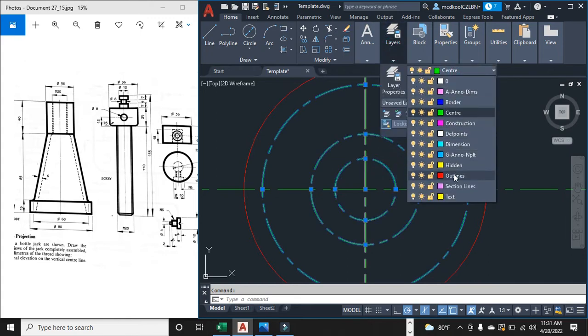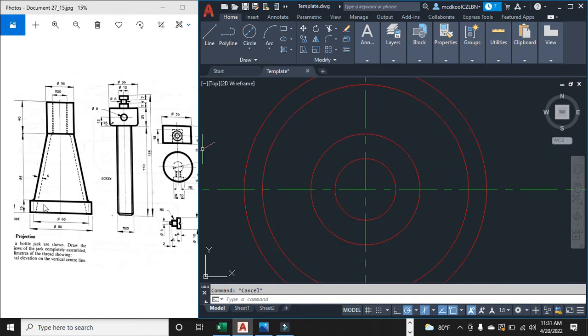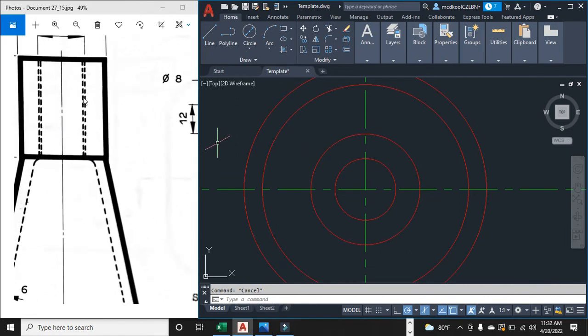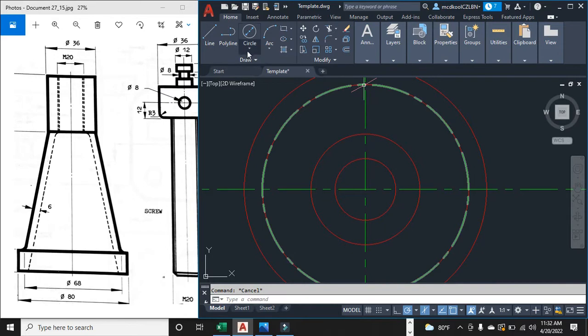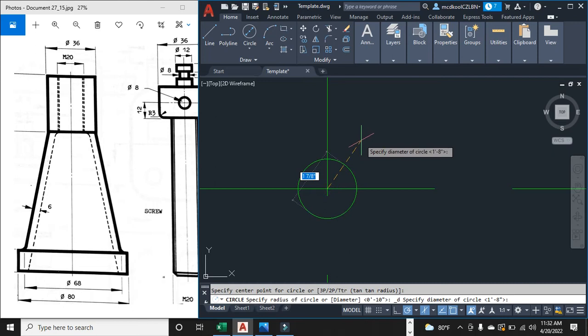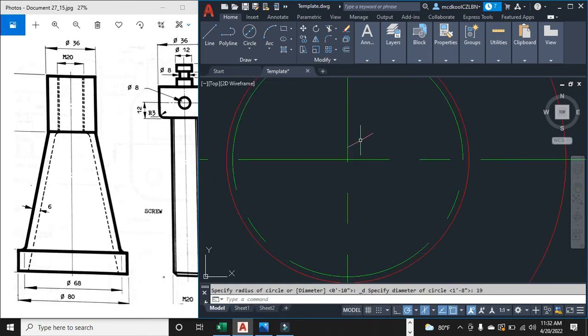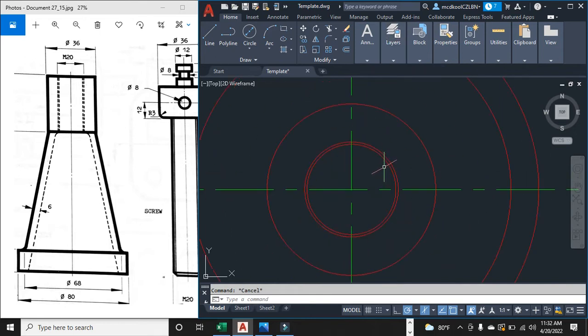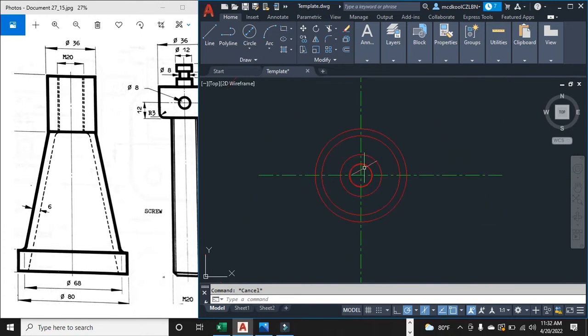So I'll just change the layers to outlines because these are going to be solid circles that are seen down here. You follow me so far? So this M20, you know it has a thread. So you can just offset that maybe at 1, or do it at diameter 19. Let's see how the 19 looks. If the 19 is too close, you could do it at 18. So this is the plan view here for the most part of that shape.